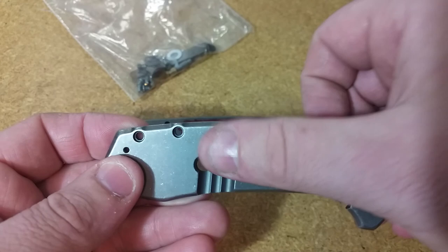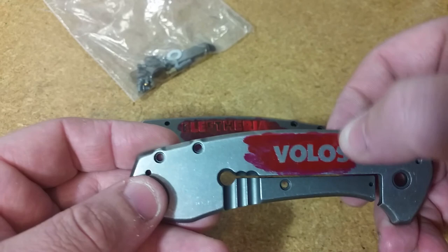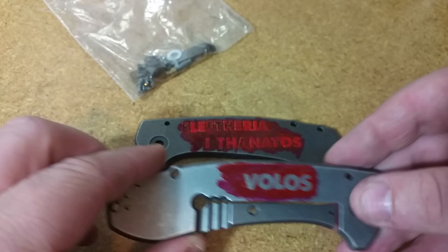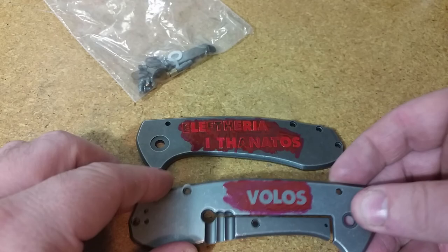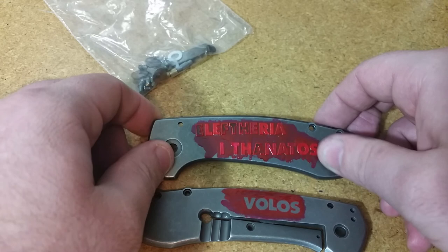The way that I've done it is I have all these stickers, and we're going to do a double-layered acid etch. The first step: I put the stickers on here and then nail polished over them, and when the nail polish dried I pulled the stickers up and then we have the word. I'll complete this design, clean this up, and then acid etch it, remove the nail polish, and then acid etch the whole thing again — creating our double layer and a pretty good-looking design. Here's how it looks with the actual sticker still on before I pull them up, and then this is the next step.